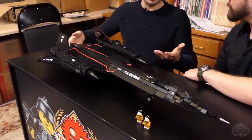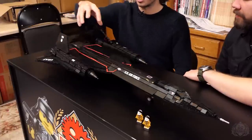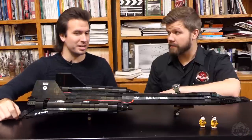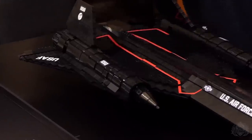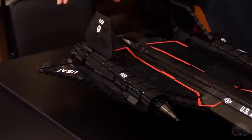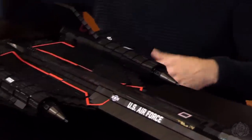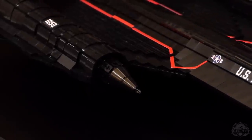Overall, once you get started, it's kind of repeatable — some of the things. Except for the engine nacelles. Those were different. To the untrained eye they look just straight, but they're actually kind of banana shaped. They start small and kind of curve and bow out as they get larger. The outside has more of a curve to it than the inside does. As well as the cones on the intakes — those are also pitched down and in slightly. It's a lot of complex angles going on.